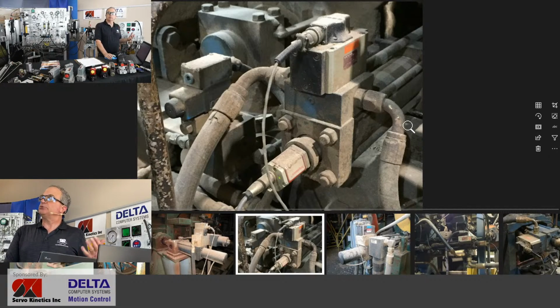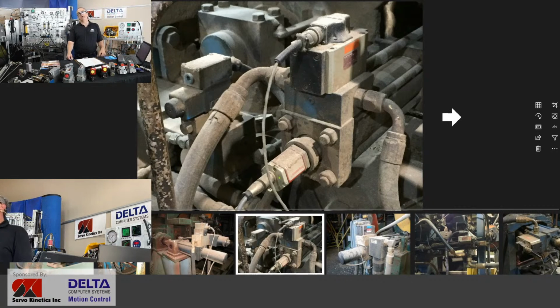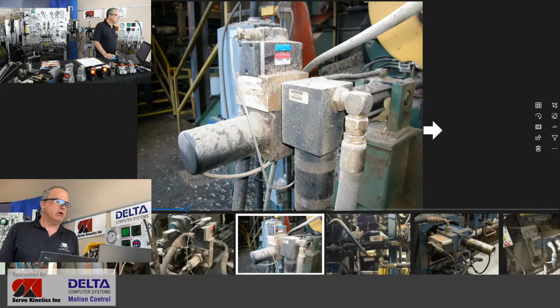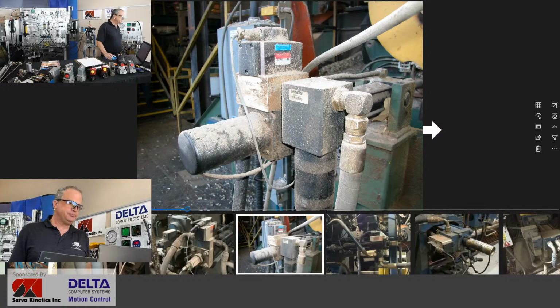And in so doing, that helps keep the servo control loop that we're going to talk about very stiff and very accurate. Is it mandatory that you keep the valve mounted directly on the cylinder? Absolutely not. If the response time for the cylinder to move to position is not terribly critical, and perhaps the final position not as critical, it may not be necessary to have the valve directly on the cylinder. You'll see some installations like that here in a moment.